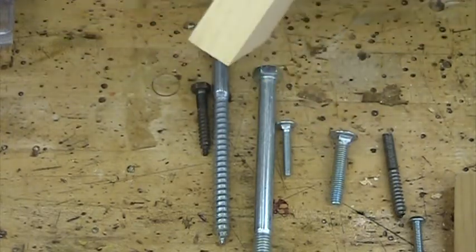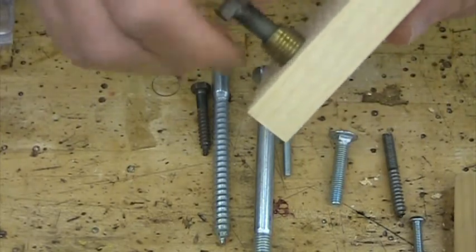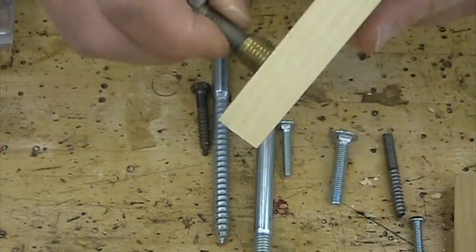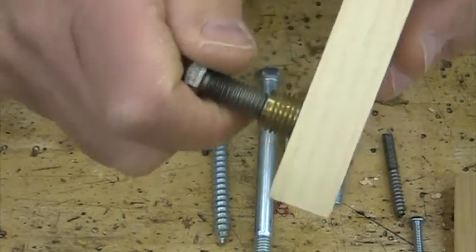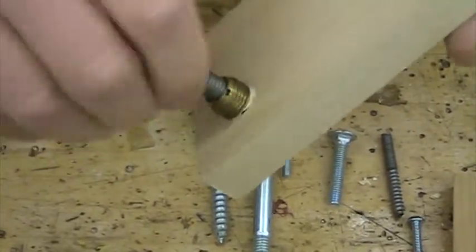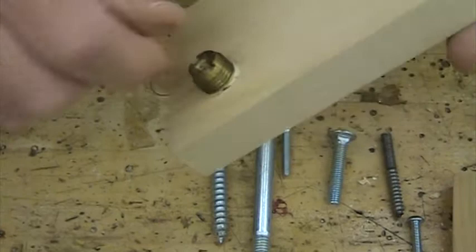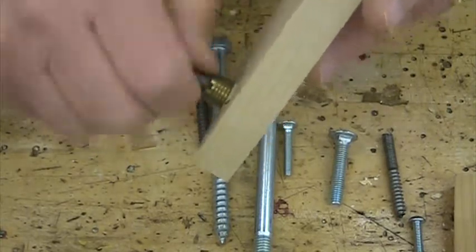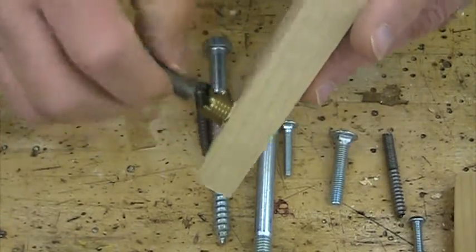I made some beds for my boys once years ago, and they're held together with threaded inserts that hold the side rails on. Every time we move the beds or take them apart, we can take these bolts out and put them back in and it doesn't wear anything out. It's a nice way to have an internal thread in something. The threaded insert screws all the way in — they make a tool that does this. If you took a hex bolt and put a nut on it, you can use that: tighten it down until the nut hits, then turn the whole thing with a wrench and it drives it in, then back off the nut and unscrew it and you're in business.